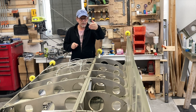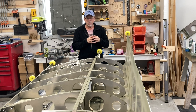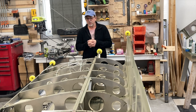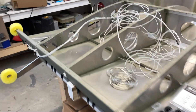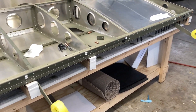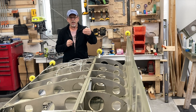As you can see, I put the pitot tube outside where the strut attachment is. It maybe is a little more prone to hit your head on when walking around under there, but I like the idea of not having to think about putting it all together. It's a good compromise. It'll have a great big red thing hanging from it. We got the measurements right — the tip is exactly the same distance from the leading edge as the factory pitot tube. Now you can see I've had to reroute and change how the wiring is going on the back. I've got some brackets — I'll show the routing in the next video. I'm staying out of the doublers completely if I can help it, which is one reason I put it outside.